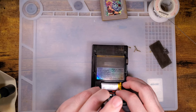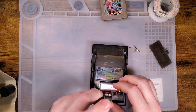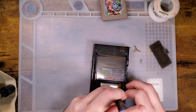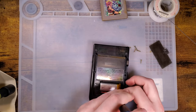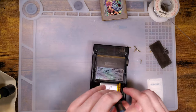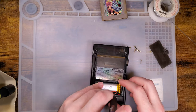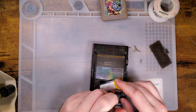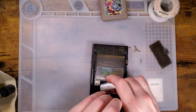There are two parts to this backlight kit. The first part — the part that I'm sure everyone knows exists — is the module that takes the screen data from the Game Boy and converts it into a format that the LCD likes and displays the data. However, when the company that made this backlight kit added the on-screen display functionality, they didn't add it to that module. They added a completely separate module that handles that functionality. And this mod hacks that module.